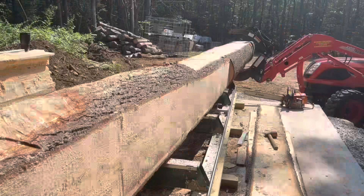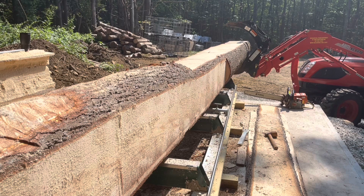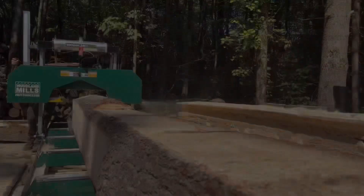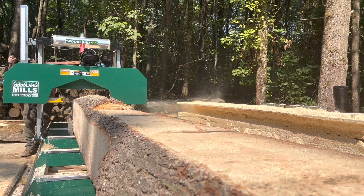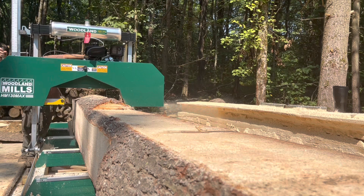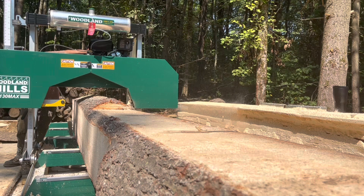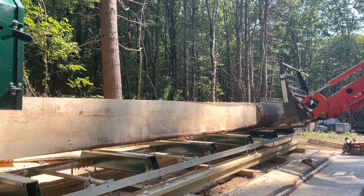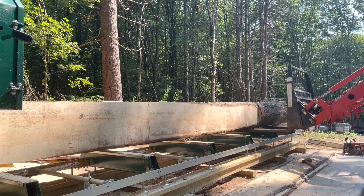There's a lot of handwork with big logs — you need muscle and elbow grease. I recommend getting a really good cant hook; I use Log Rite and have videos of using it, including a tour of the Log Rite facility in Connecticut where the cant hooks and peaveys are made. Here I'm finishing up the cut — you'll see it lines up nicely. If you're off, keep the blade higher than you think you need to be. You can always lower it and recut, but if you're below your other cut there's not much you can do. Air on the side of caution, leave it a little proud.